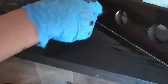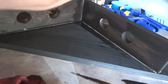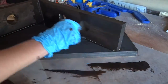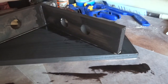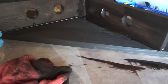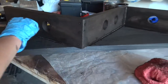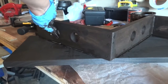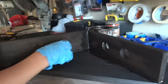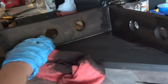And even on camera you can see how nicely the wood grain comes out with this stain. This is something like a Kona or Java. Using a Q-tip is a great idea which I have not seen in any other board, and of course you need to go over each area several times, but it's the most effective way when you have small gaps or small marks made by nails or any other small imperfections in the wood.